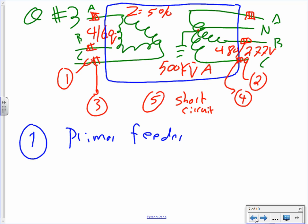You're going to get sick of grounding the system versus grounding the equipment. I really do have a very good sheet that I'll give you guys next week or the week after, where we go over all the bonding and grounding and the difference between them. Just remember right now, one grounds the windings, that's the grounding electrode conductor. The other one grounds the frame. The equipment ground grounds the frame.